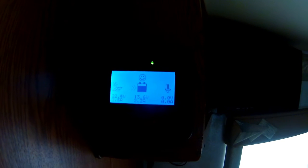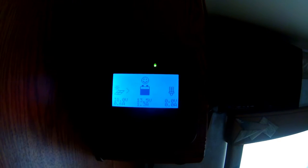Right now you can see I'm pulling in 22 volts, batteries at 13.6, pulling in about one and a half amps, converting it to 2.2 amps. The batteries look pretty good right now, but as soon as the panels stop producing power, those batteries drop right down to about 10.4 volts. You can see the voltage just jumped up to 39 — a cloud going by.